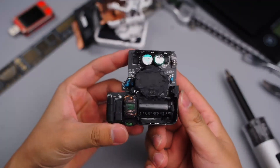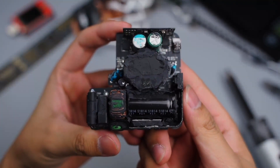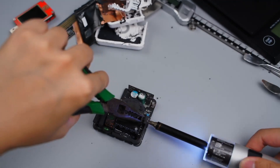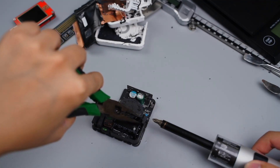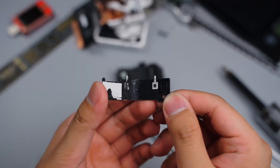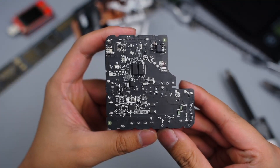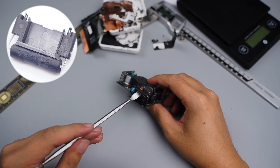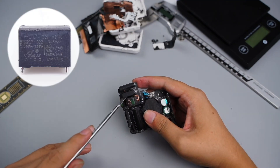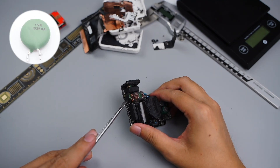Here is the front of the PCB. We can see capacitors, transformers, rectifier bridges, etc. An L-shaped metal heat sink is on the side. On the back, the SMD components include the fuse, and common-mode chokes used to filter out EMI interference. This is the safety X2 capacitor. The varistor is used for input overvoltage protection.